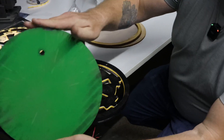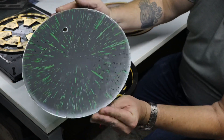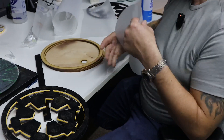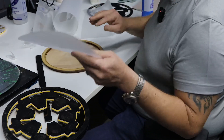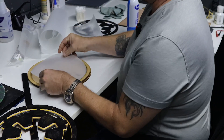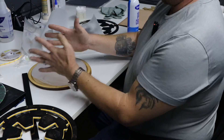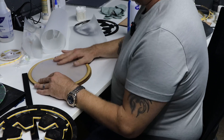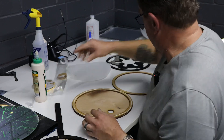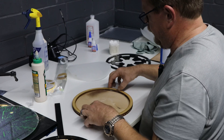Having taken that mirror, what we did is paint the back — a little bit of green fluorescent paint, but not too heavy a coat so the light will still go through and you'll be able to see it. Here is my back with two rings as a spacer. I also cut some diffusion paper — so instead of seeing individual LED lights, it'll spread the light over the surface of the diffuser and you're going to get a much more even lighting throughout. This is just to create a space to run the LEDs and then the diffuser with it.